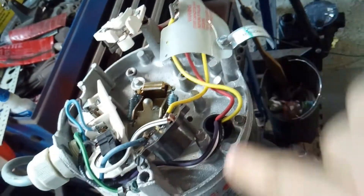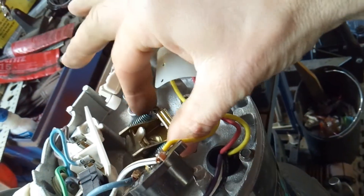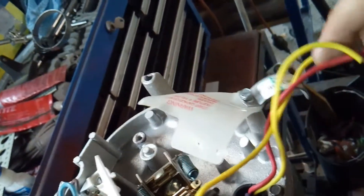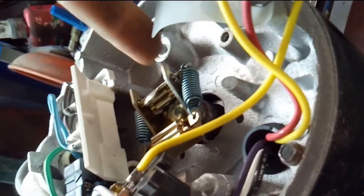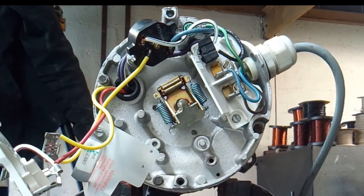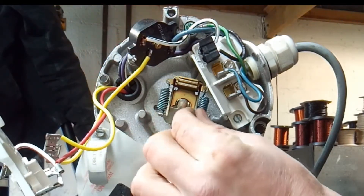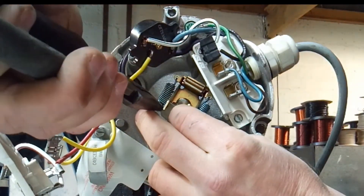These are the four through bolts that we're going to have to take out so that we can remove the rotor — and the rotary part of the centrifugal switch has to come off first. Normally I'll do this in the vertical position up on the vice, but simply for camera angle and so that you can see how it's done, I've put it on the side.